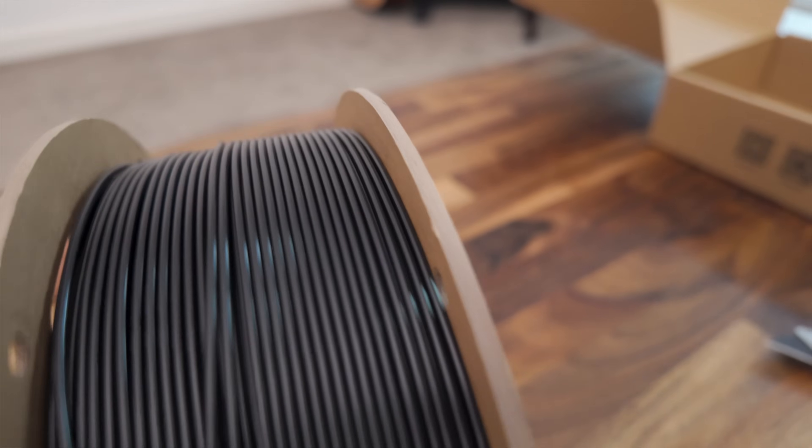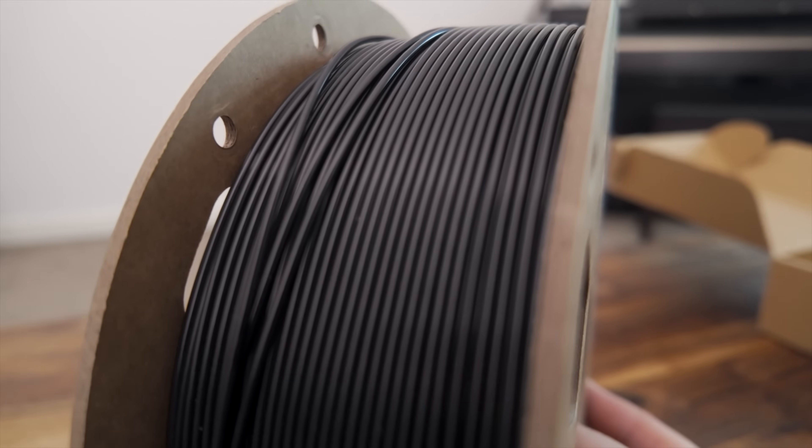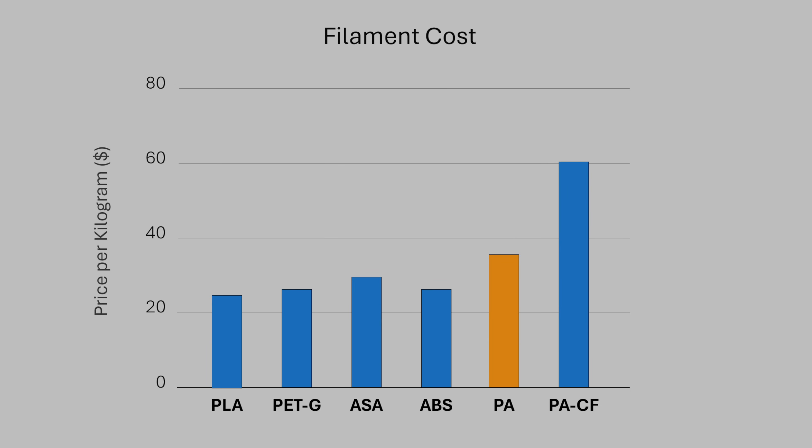But there's something else that makes nylon stand out. It's got a low coefficient of friction, which makes it slippery smooth — a lot of nylon clothing feels silky smooth for this reason. This low friction and high toughness makes it an extremely wear resistant and long lasting material, perfect for mechanical parts like bearings, gears, and sliders. The cherry on the cake is that nylon is really cheap — one of the most affordable materials in industry, which is why it's so widely used.